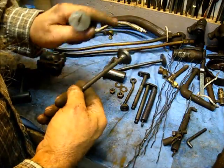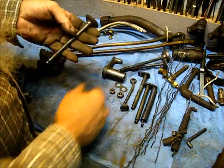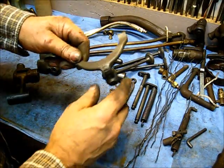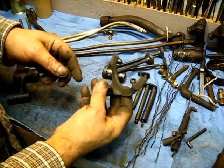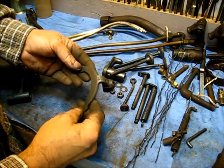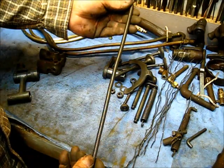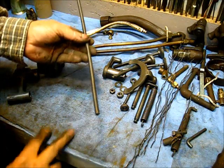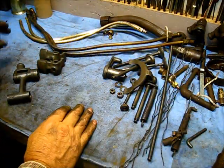That cleaned good — and that's two different kinds of metal: cast iron head and some type of steel shaft. The governor shoe cleaned up and you can see it as cast metal. I've been using this right here for a year or two, and if you micrometer it, it's the same size. No erosion.